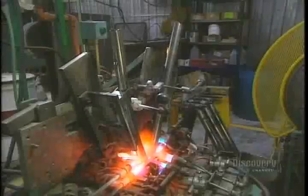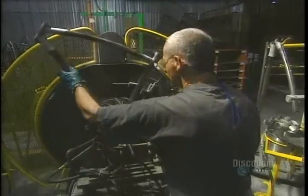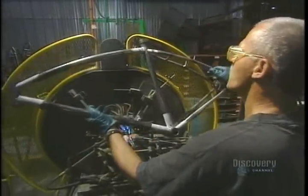They insert a piece in an alloy of silver and bronze, which increases the strength and produces a better finish at the welding point. Welding now takes place. Welding of the frame requires about 2 minutes at a temperature of 800 degrees centigrade. Once welded, the part takes 4 minutes to cool. They proceed in the same way with all the tubes which form the frame of the bicycle.